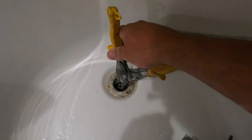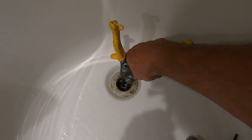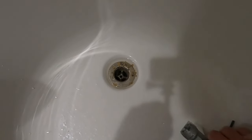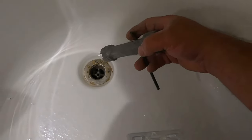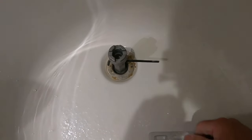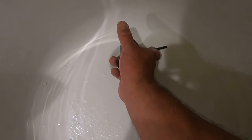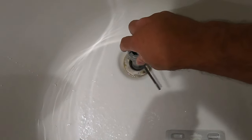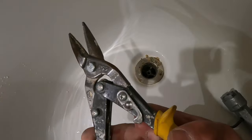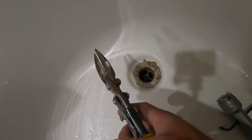Typically we use larger drains for new construction. There are two ways to take that drain out. One way is putting your tin snips or large pliers and basically turning it like that. Or you can go to Home Depot and grab one of these drain removal kits. These teeth basically just fall into the drain, and you have this little Allen key here for leverage, and all you want to do is turn it like that. I will leave a link in the description below if you guys want to order one of these. These are my tin snips — they're for cutting metal studs, but they do a lot of other things.